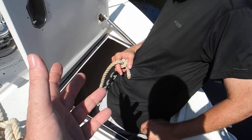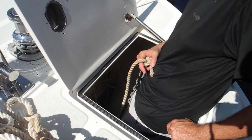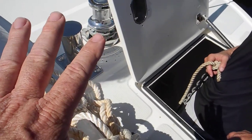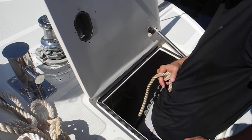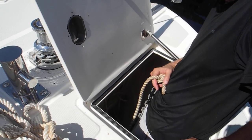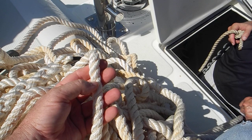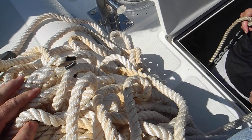Is there anything on the boat called an anchor snubber or a bridle? None has been seen. You cannot anchor this boat to the anchor chain — you need some sort of an elastic device, which is a snubber: a rope with a chain grabber or chain hook to hook onto the chain. Even though this is rope, a chain snubber or chain grabber provides the elasticity needed.